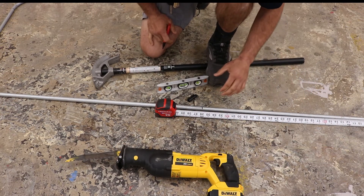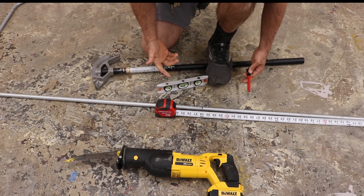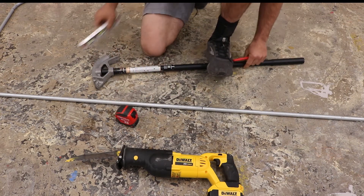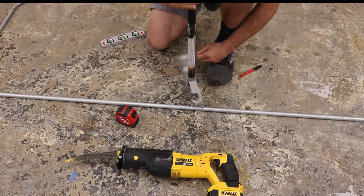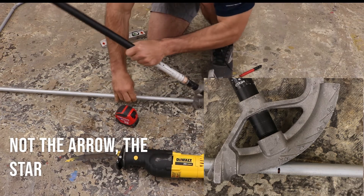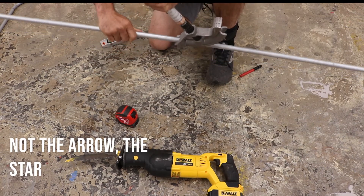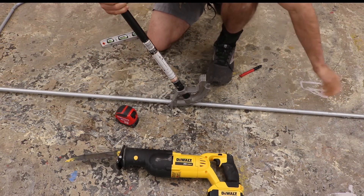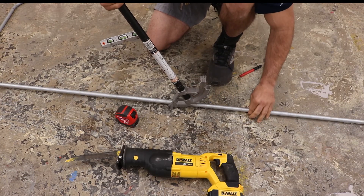With this method you do not subtract the 5 inches. I measured from my left, so I'm not subtracting the 5 inches and I'm going to use the back of the bender. Last time the bender faced the way we measured; this time you turn the bender around the opposite way. Insert your pipe, and you're going to use the arrow. I measured from the left and pulled my tape measure that way, but now I have the bender the opposite way — you'll see why in a second.